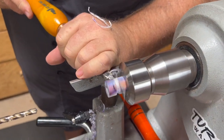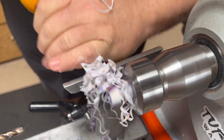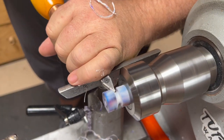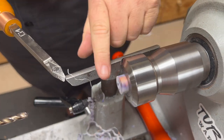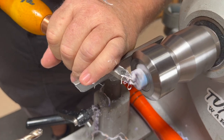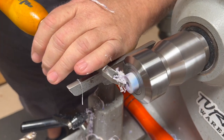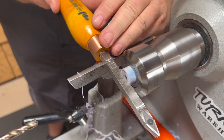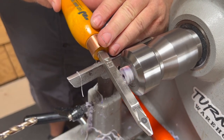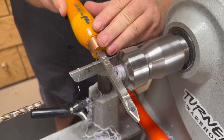I like this because it just gives me a little more control on a more delicate part. You could take it to the saw, or take it off with a parting tool — whatever you want. That hole just gives me a little easier access. I can make sure I'm as square as possible. If it wasn't square, my tool would be vibrating or making a thumping noise. So I know I'm pretty good there.